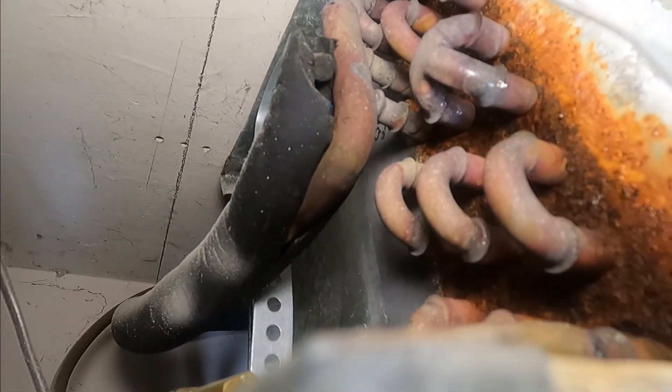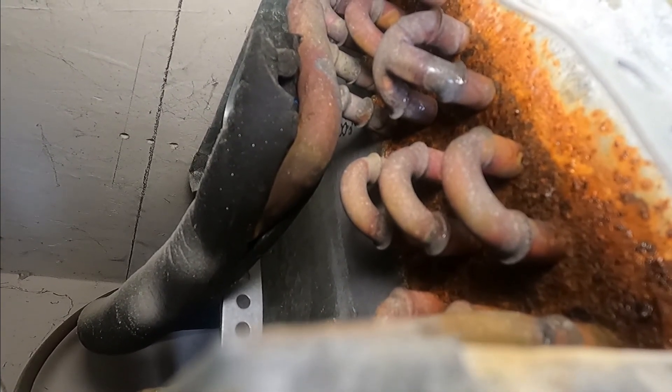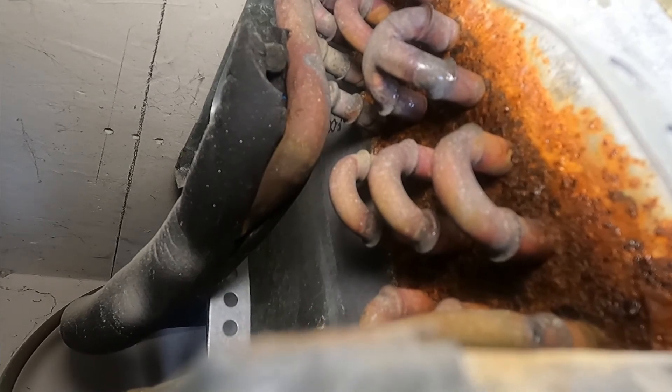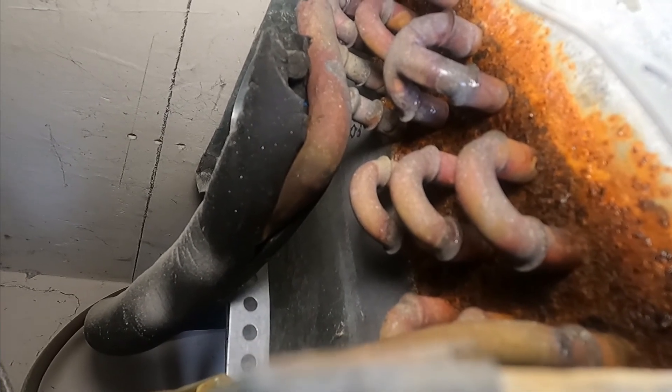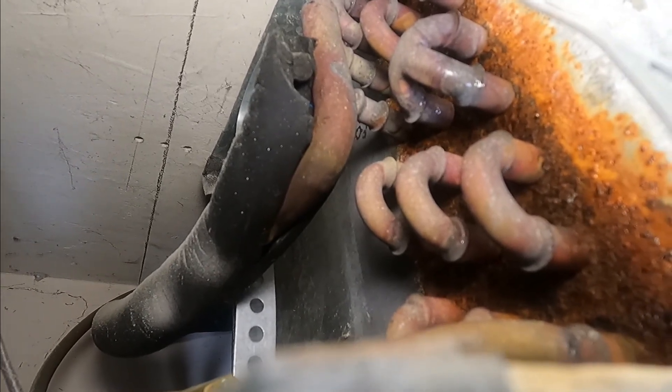So of course that tells me the tray and the drain are fine. These are the coils — they are not frozen. I told the customer to turn the unit off when he called me, so he turned it off this morning. If it had been a frozen evaporator, I would have had to wait a few hours thawing the ice.